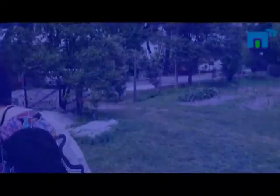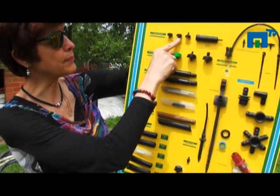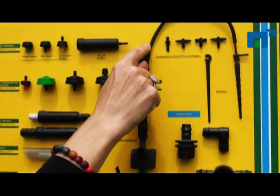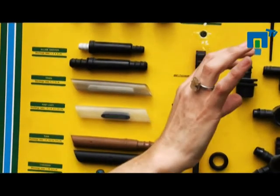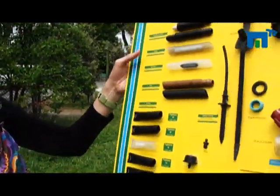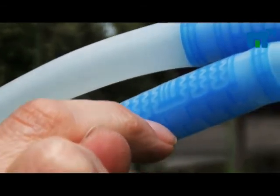What are the typical elements for a drip irrigation system? They are the drippers. There are different types of drippers — they have the advantage that if you need several discharge points you can do it with a small tube. We have inline emitters, meaning the pipe is cut at both ends and the emitters are inserted within. The most typical models are integrated models, and all of them have in common a labyrinth structure, as you can see here, with protrusions and different angles.